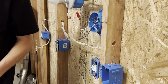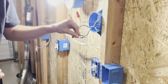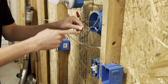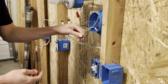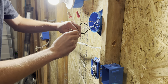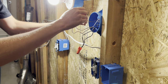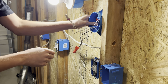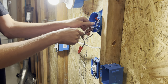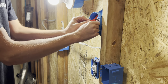Now to do the hot work — once you touch the wires together the light's going to turn back on. Sometimes that'll make a few little sparks but nothing to be concerned about. Just line up your wires, hold onto the insulation, then put your wire nut on there like normal. Obviously people have been freaking out — don't work live if you can avoid it — but in certain cases when you can't avoid it, it's going to come up. If you're an electrician it's bound to happen, so it's good to know some safety tips on how to work live safely.